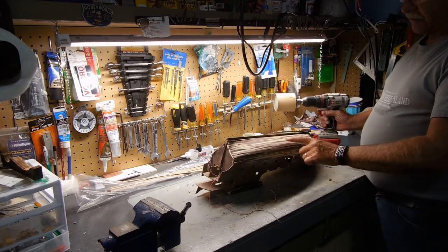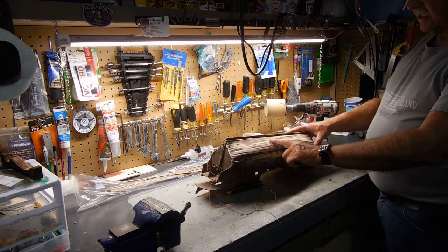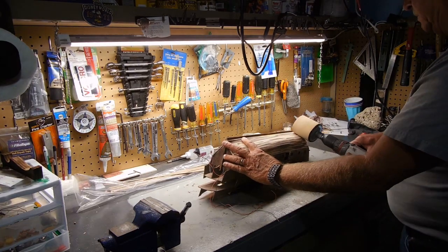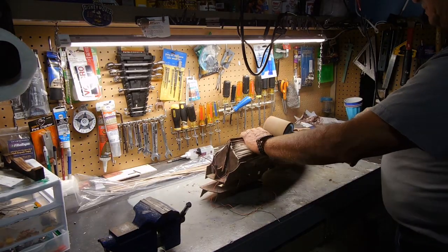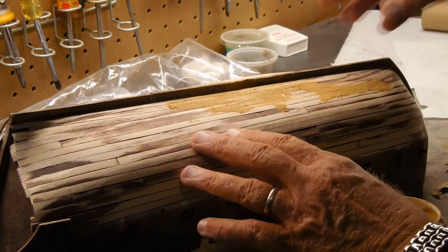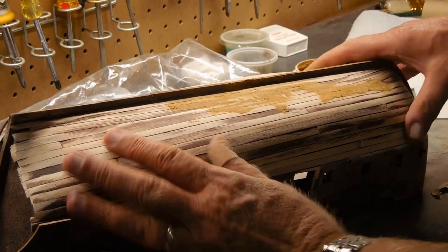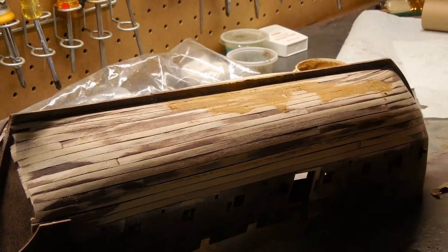That's what's nice about pre-staining your planking — you can see the dark space and identify dips. I can try to smooth them out or put a little putty. I'm finishing up a couple of low spots using wood putty — it says all-purpose fill — and I've just kind of scraped it off.